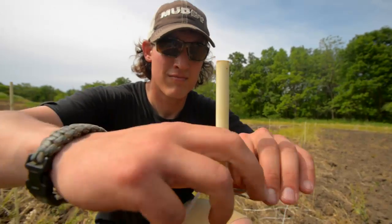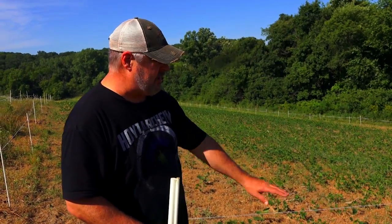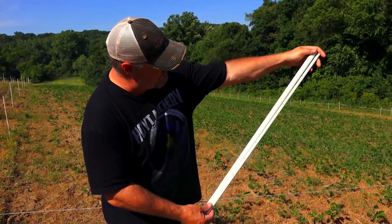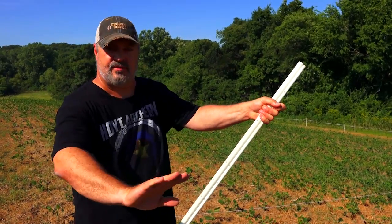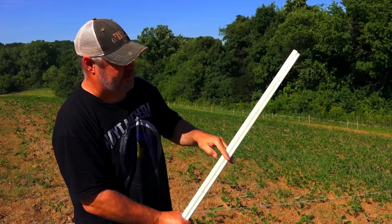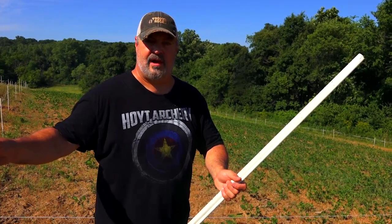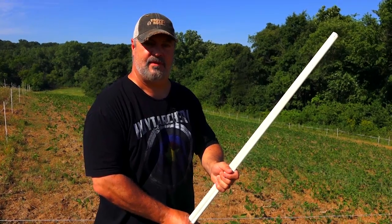As you can see in the fence behind me, we've got all our posts in, our inside wire in, top wire in, and our outside tape in. Each post has five holes — on the outside, the tape always goes through the second hole from the top. The two inside cables go in the top hole and the third hole down. Then we'll run all our wires over to our solar panel and energizer, put our battery on, and hopefully keep deer out all summer.